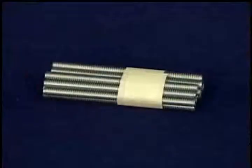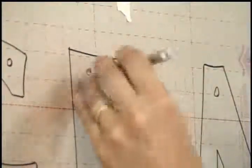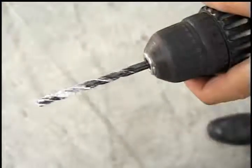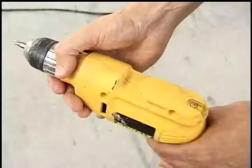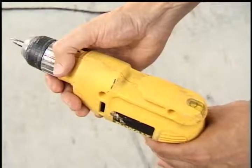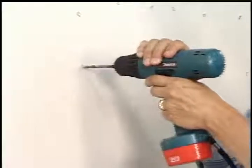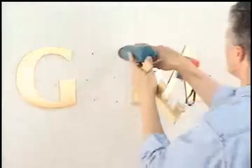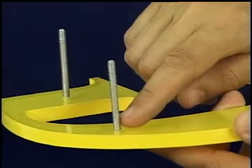Now that's it for the stud mount. Let's review some key points. All standard letters will be sent with 10-24 by 3/16th diameter studs. Locate hole centers through the pattern with a center punch. Use a drill bit slightly larger than the studs to allow for some letter adjustment. Use a drill with a bubble level for straight holes. Your stud should go at least two inches into the wall for a secure installation. Adjust your letters after drilling holes before you apply silicone. Laser cut acrylic letters can be ordered flush stud if at least three-eighths inch thick.